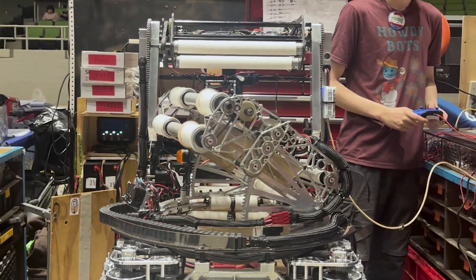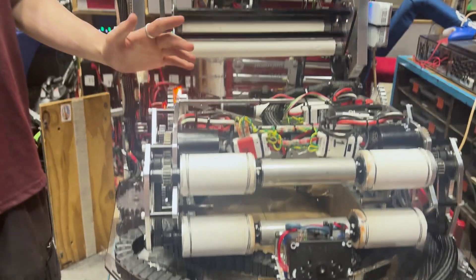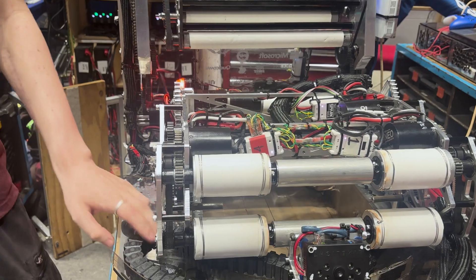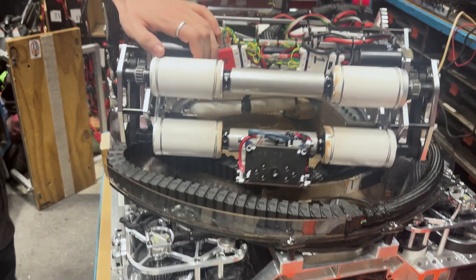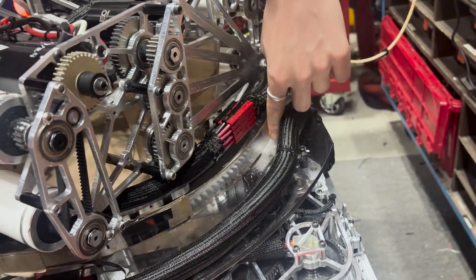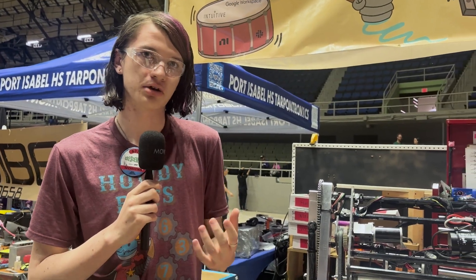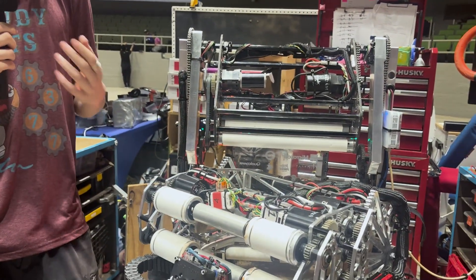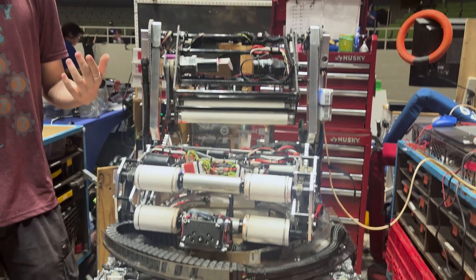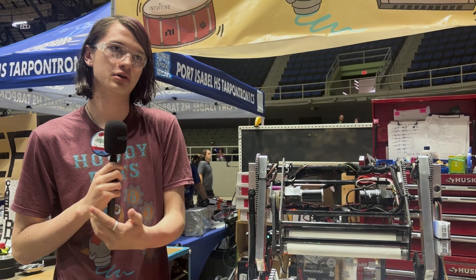You may also notice, if you're really into control systems, that this turret is on a giant gear. We can't easily have an encoder on it, so what we do is we have two encoders hooked up — one here and one over there — on different gearings. By calculating the difference between them and applying something called the Chinese Remainder Theorem, we are then able to calculate the turret rotation without needing to power up in a specific orientation. We can start in any orientation and not have to worry about turning on in a specific position.